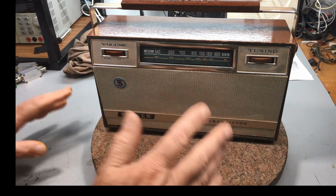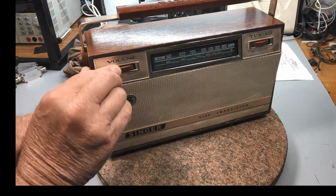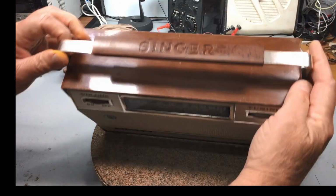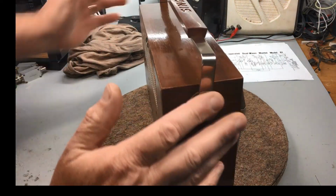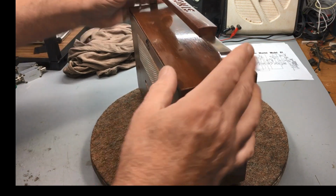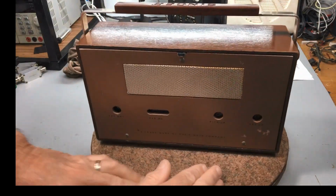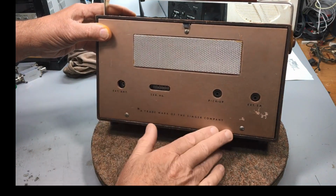But as I said, it was a very, very straightforward, basic alignment. Nothing really, just the alignment of the dial. Works very well. The handle came up rather nicely. The Bakelite handle came up beautiful. I'm very happy with this, actually. It's not quite how it used to look, but it's very close, and the handle folds down nicely. And comes up. The pickup works on this. The extension speaker works. External antenna, well, we probably will never use that.